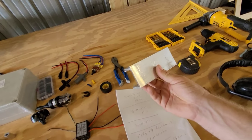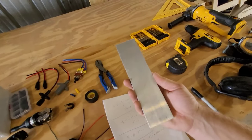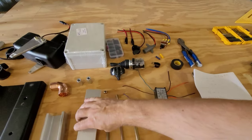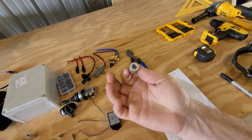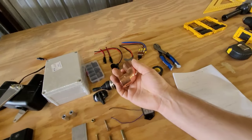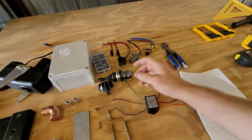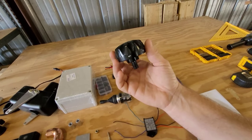The aluminum here is two inches wide by one-and-a-quarter inches tall, one-quarter inch thick - you'll need about 24 inches total. I'll try to link that in the description. You'll also need a little piece of flat metal, two inches wide, either three-sixteenths or one-quarter inch thick, and you only need 10 inches of that. You'll need two aluminum spacers made for a five-sixteenths hole, one-and-one-eighth inch long. You'll need one one-inch copper elbow - that's your topper for the trolling motor - and a control knob for your factory switch so you know forward, reverse, and speed settings.